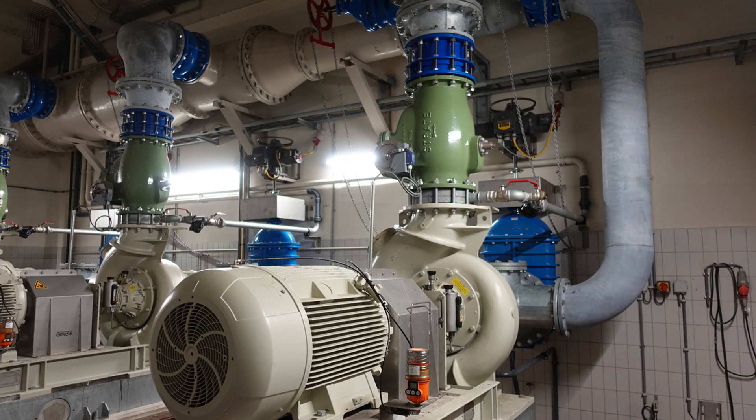Let's take a look at an application where we use a check valve. In this photograph we see a very nice big centrifugal pump, and right above it we have this green piece of equipment — that is actually a non-return valve, a check valve. We can also see that it has an arrow, the arrow is up and it's in the right direction. You can always check whether it is installed correctly because the arrow needs to point in the flow direction of the fluid.